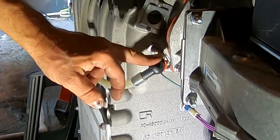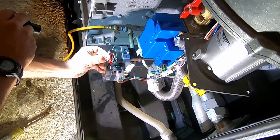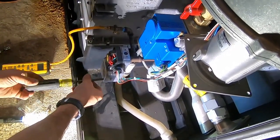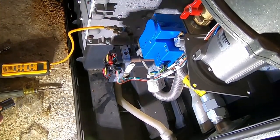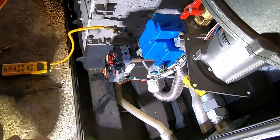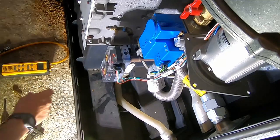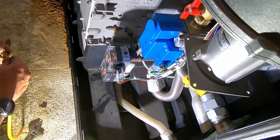It's got a flame sensor readout on this — it'll tell you exactly how strong the sensor signal is, which is pretty cool. It's set right at 14 inches, so I don't know why that would be triggering — that's a little odd. I wonder if it's triggering on a low end, because it has a low-end setting too. These are set correctly and I can't change them, so we're going to leave those alone. 14 inches is what it says on the outside of the boiler as its maximum pressure. I'm not sure why that's tripping — we are technically in a safe spot. Other than maybe the gauge being inaccurate, that's about it, unless it's actually peaking — in which case you need somebody here with a meter to monitor it.